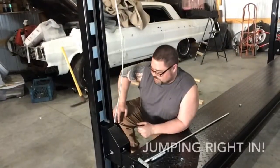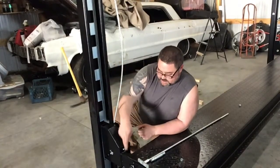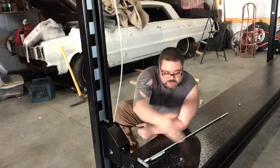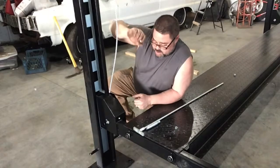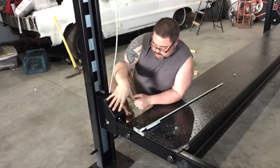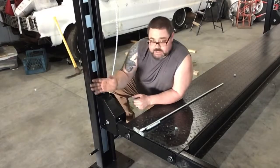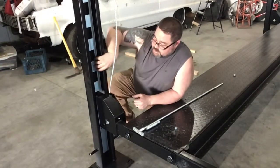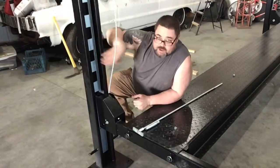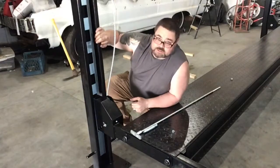In the instructions, we found out that as we started putting these together, it doesn't really say anything about making sure that the cross member piece is put in before you put in the rails or the top. So as you assemble this, make sure the rails go in between your uprights first and get installed. Then you can put in the slotted rack for the adjustments, the lock-in, and the top pieces.